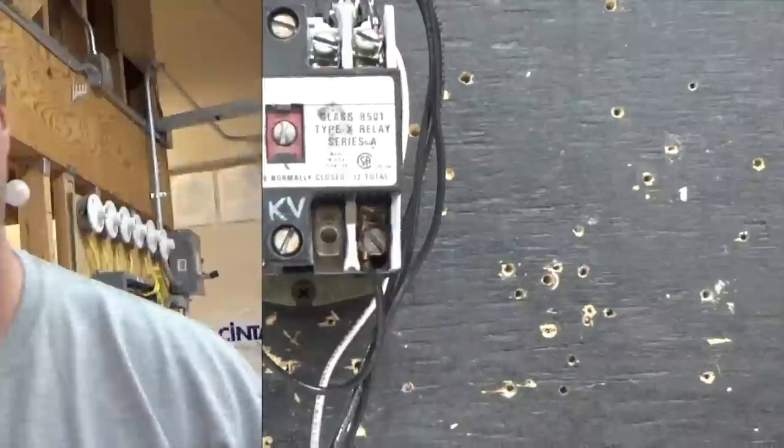Now that's probably one of the most important things you have to remember, is you have to get power to everything. So again, just like a single pole switch, make sure you jump every contact out. If you're using two different power sources, make sure you have the right switches with the right power source. At the same time, always make sure that the power you're bringing comes off of the stop control button at some point, because you want to be able to take power away from it, especially for the hold.